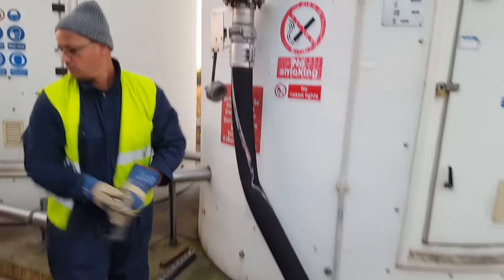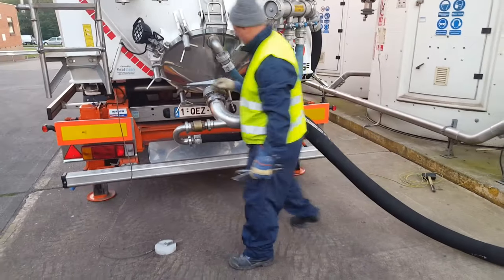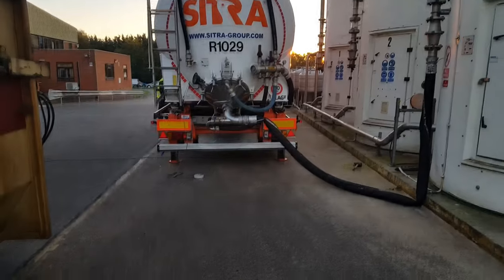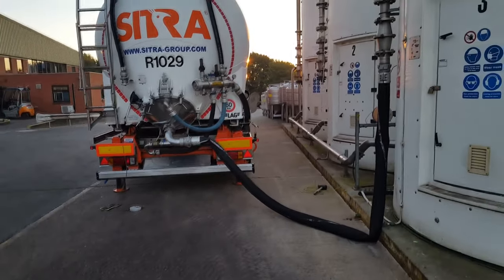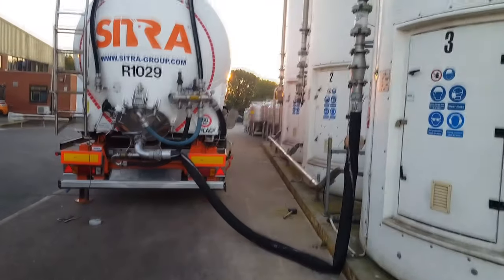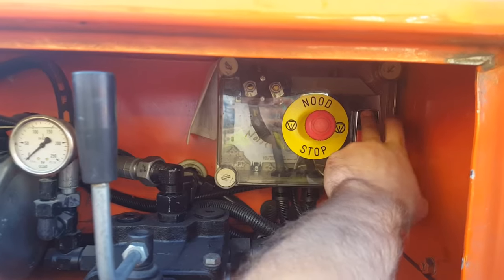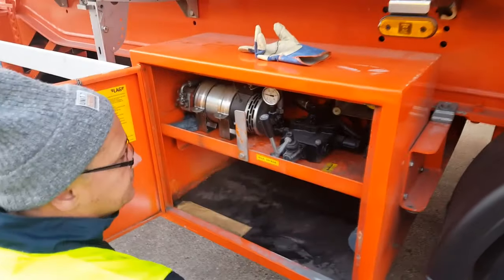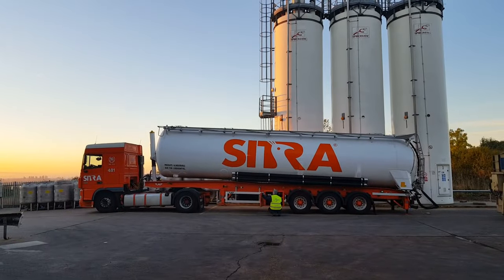After we've mounted everything together — the legs on the ground, the earth cable, and everything well fixed — we start tipping the tanker. With the tipping engine in neutral, we push the start button and pull back the handle.